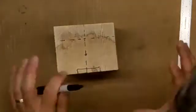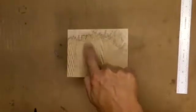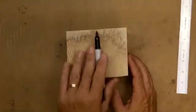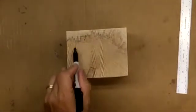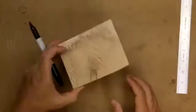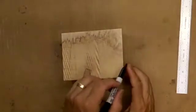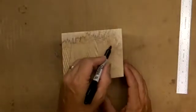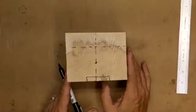One thing I forgot to mention, and I'm going to back up for 1 second, and that's real important, that the wood has growth rings. And in this case, I'm going to identify the growth rings as frowning. Even though they're not centered, if they were centered and they'd be perfectly centered and frowning, that would be better. But generally, they're in a frowning motion versus if I flip it over, they'd be what I would call a smiling motion. And physics with the compass forces me to draw this in a frowning motion. And it looks better when the arc follows the growth rings to a degree. So this is frowning, and I'm going to cut it the same way. So I set the bowl up to accommodate for that. I just forgot to mention that earlier.